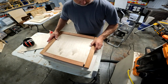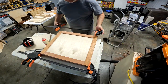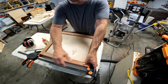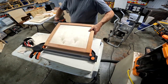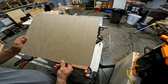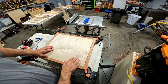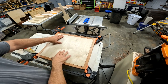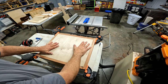We'll put this back on. This side is not glued — only this side. Flip it over. I'm going to test fit, and remember to put your good side inward. That way when you look at the box from the inside, you don't see it on the outside. Got a good fit there. I'm going to put some glue around that bead and just take a pin nailer — you can use a brad nailer if you want — and nail this down while the glue is setting to help keep it from moving.